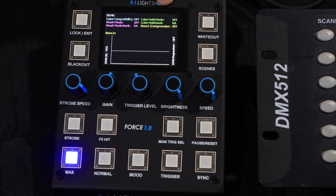Now the Force 1.0 can act as a DMX repeater if you enable that function. Essentially it'll route the DMX in signal to the DMX out and bypass internal control features of the Force 1.0. Now the benefit here is that both input and output are fully isolated RS-485 DMX 512a compatible interfaces on the Force 1.0, where many external DMX controllers are not fully isolated. So you do get that benefit here.